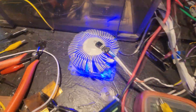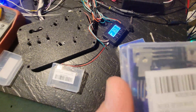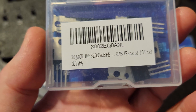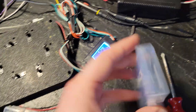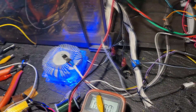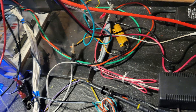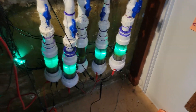Alright, today we are comparing MOSFETs. We've got the BoJack series of MOSFETs. We are comparing the IRF 510, 520, and 540s today. We had a pack of 530s — we burned them all up because we didn't have our snubber in place. So today we're going to put this on the oscilloscope and see which MOSFET performs best for my operation.